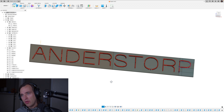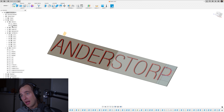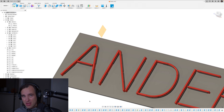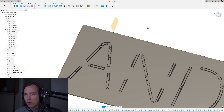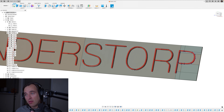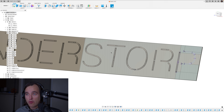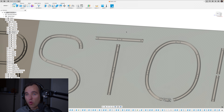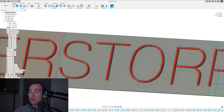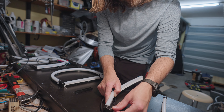So we instantly knew we had to be able to divide the sign if we built a new one. We mapped out how the new one would look in Fusion 360 and split it in half with a hinge between. The real problem was making the letters nice — the old ones were done freehand and looked terrible. So we came up with the concept of printing small holders and guides on the Prusa Mini that we could place the LED tube into. These 3D printed brackets screw directly into the board and have a slight taper angle so they clamp the LED tubes — no glue or extra fastening needed, as the natural friction between the rubber and 3D printed plastic holds everything in place.